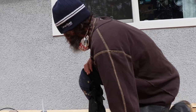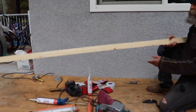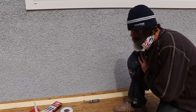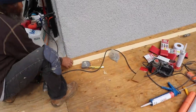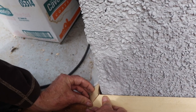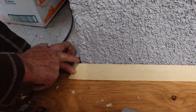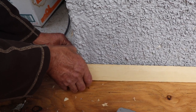Another thing we're gonna do — I have this pre-cut piece here. You can see it's cut on a 45-degree angle; I believe it's cedar. We just pull it on the corner and screw or nail it on. But before I do that, I want to put some caulking to fill in the gap — I want it sealed. I already have this pre-cut; I'm just gonna match the corner. There's a little bit of a bigger gap because the wall is not a perfect 45 degrees — it's indented a bit — but we just plan to keep this tight to the wall.